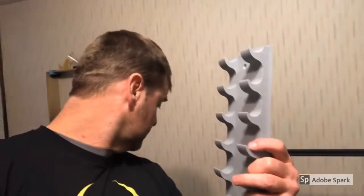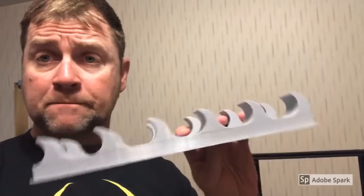I did two really serious prints with the Amazon Basics and it was just fantastic — I had zero problems. It printed best at 205°C, which is typical for PLA for me. There are some printing flaws but that has more to do with my slicer, not the filament. No problems whatsoever.